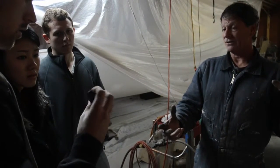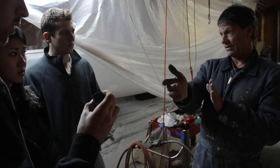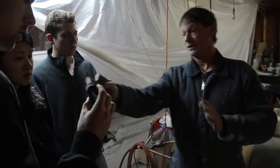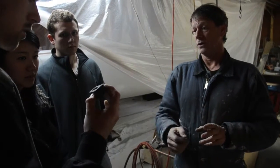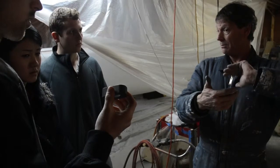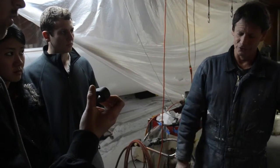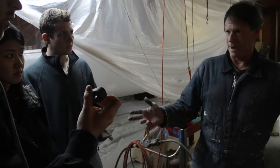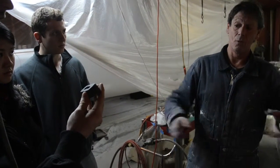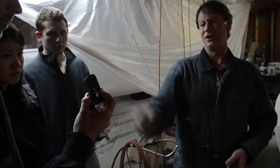And then that's 2 pieces of angle iron opposing each other, and that thing sitting in them. One had a different radius, so it's just the two clamped against each other. Put it in the oven for an hour till the resins were flowing. Then just by opening the door, created a natural ramp. Reclamped everything, shoved it back in, and I mean it's a pretty clean outside surface.